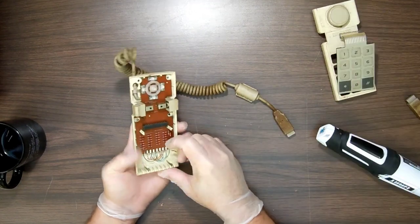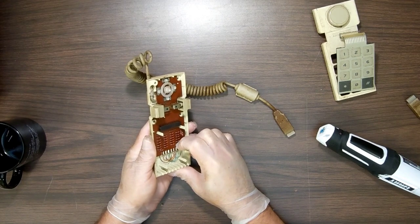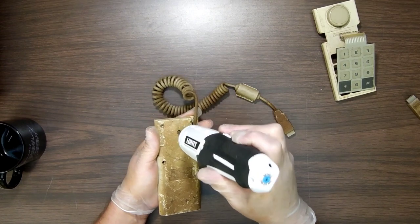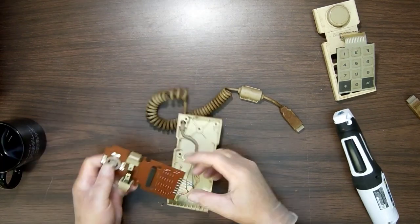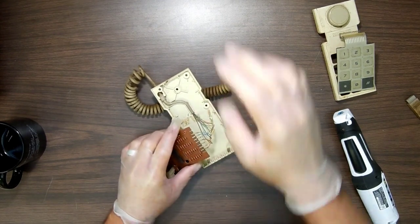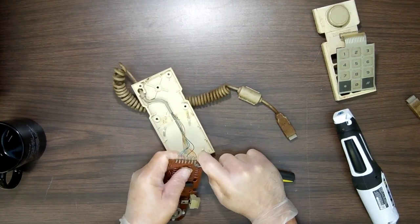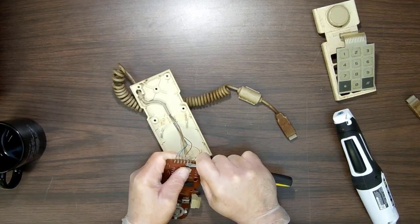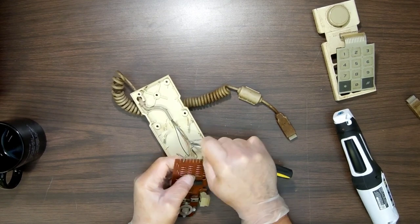So I just pull the keypads up, pull all that off. I'm going to be scrubbing. I was debating if I want to take the actual cable off, but that cable needs to be soaked in water. Because you can't get the cable out, you have to, with the Adam controllers, sometimes they slide off, sometimes you gotta take a piece of metal or something like that to push against them. But just pull them out. Now when I put them back on, I will probably end up having to solder them in place, because they're not made to be used again when you put them on the second time.